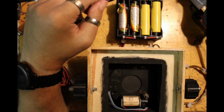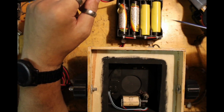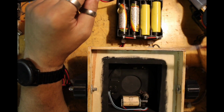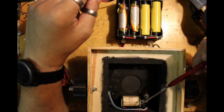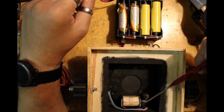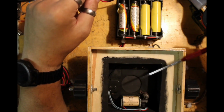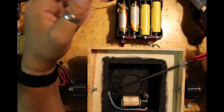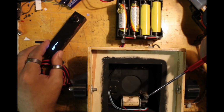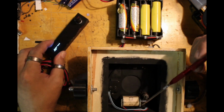And one thing I do want to make absolutely clear, I mentioned it in the documentation on the GitHub: this system will only operate DC powered, direct current battery powered shutters like this. I know Packard shutters have a 12 volt, 24 volt, and a 120 volt AC version of this type of shutter. The AC version is not as common, but there was a line of cameras specifically from Beatty that used the AC Packard shutter.